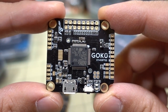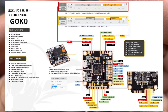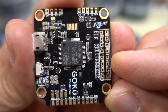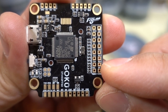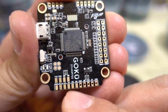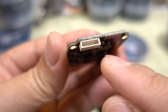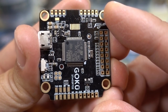Here is the flight controller - it's an F7. I'd refer you to the wiring diagram if it's available, I'll put it up on screen. This is all pretty standard and straightforward. This is an F7, so it's going to have at least six UARTs. You can see all the UARTs here on the right - TX1, RX1, 2, 3, 4. You have connections for your compass if you need it. Down here are solder pads for your motor connections - motor 1, 2, 3, 4, and current sensor. So you can direct solder from the flight controller to the ESC, or use their plug if you prefer. It gives you two choices, which is nice. You've got the boot button here and USB port over here.